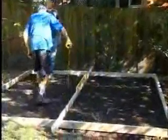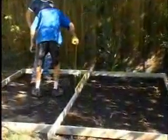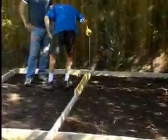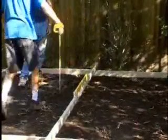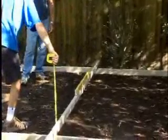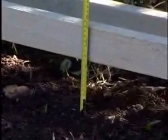It is important to check the depth of the area you will be filling with concrete. Place a straight-edge timber board across the length and breadth of the box. Use a spirit level and check the depth of the area within the box. Remember, it has to be 100mm because that is the thickness of your slab. Fill in areas too low and remove those areas too high. Ensure that the fall of the slab follows the contour of the land.